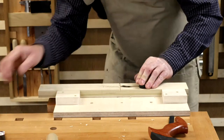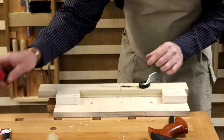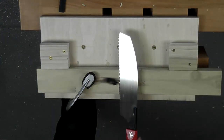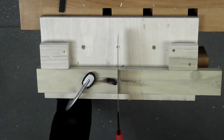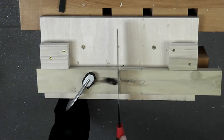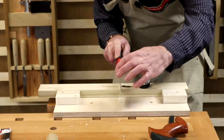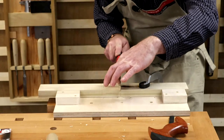Okay. So what should we go? We'll do a mixture. We're going to do the Japanese one because I want to give you that indication of how easy this is. I've just dropped into that knife wall that we cut with the chisel, slide it up, pull. So as long as I keep my saw on that shoulder line and not twisting across my body, pull it towards me. I want to support it. I can stretch my fingertip carefully.